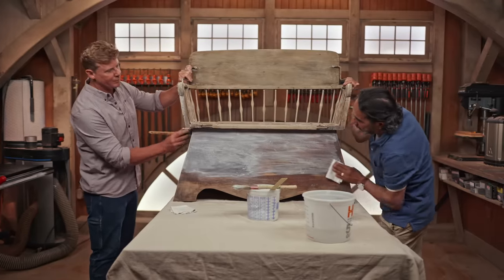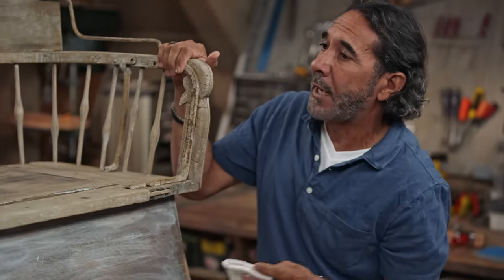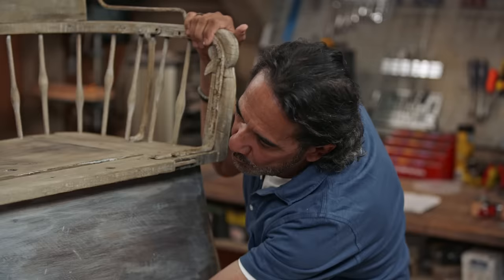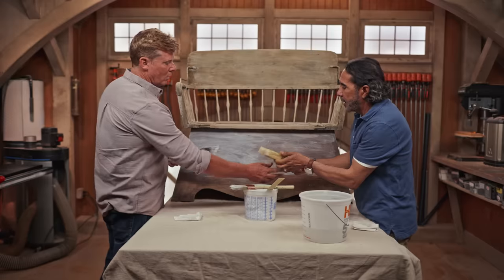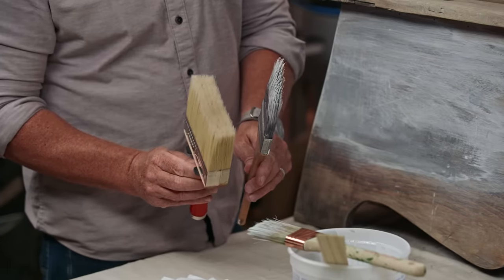Are they different? They have some similar looks once it's done. But in limewash, you have limestone powder mixed with water. The technique you use for limewash is different from whitewash, and also the paintbrush you use is different. With limewash, you use a box brush, which is a thicker brush — it holds a lot more material and creates the pattern you want. That's the kind of brush used for limewash paint.